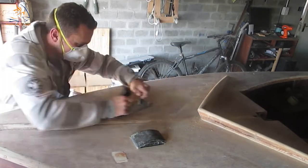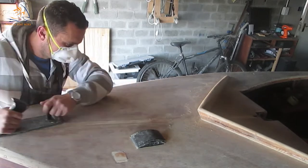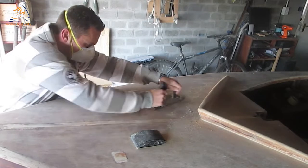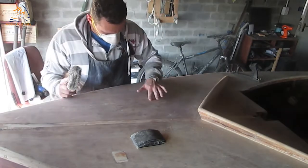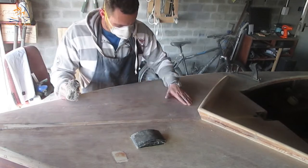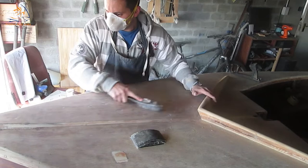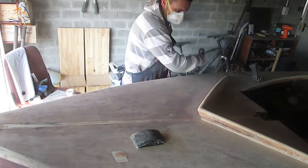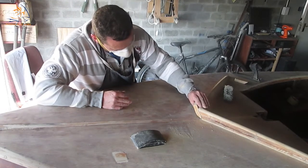From there I'll move over to a sanding block — a medium sized block. As you can see, I hold the block at an angle so that I don't sand low spots and so I can work with the curvature of the boat. I'm working with the grain, at a slight angle to it, and then I'll look for any low spots. I've pre-cut this little block with a whole lot of different angles and use double-sided tape to attach the sandpaper.